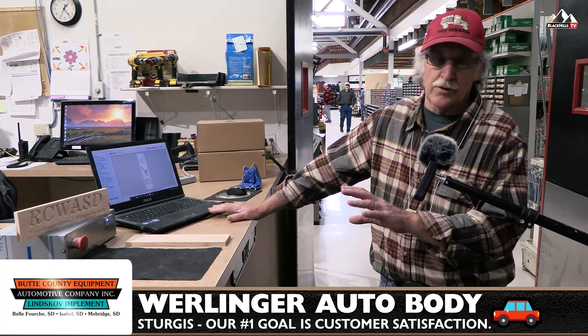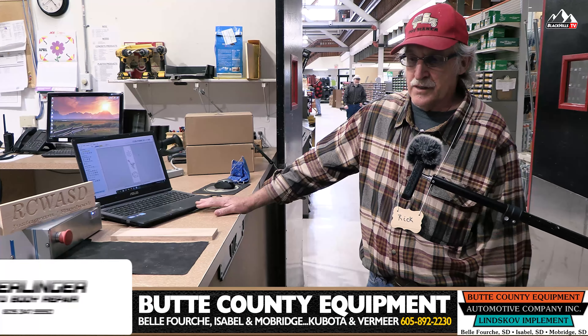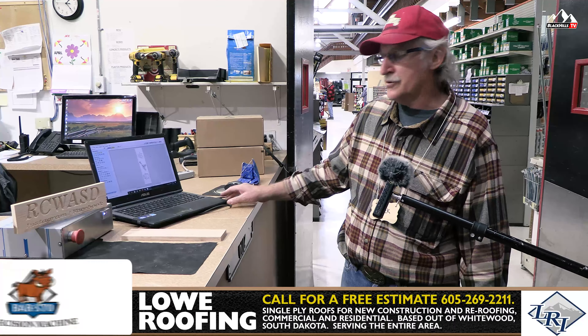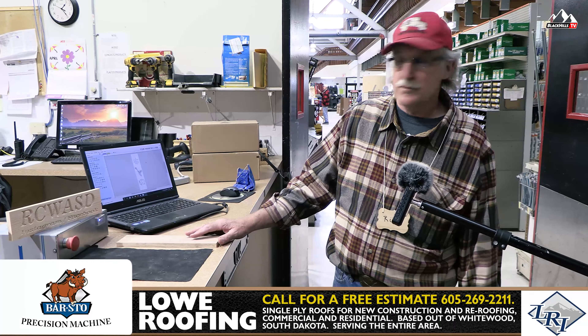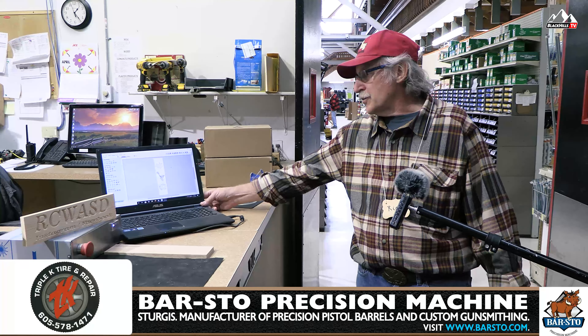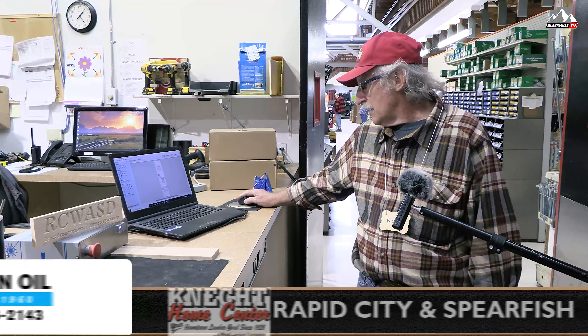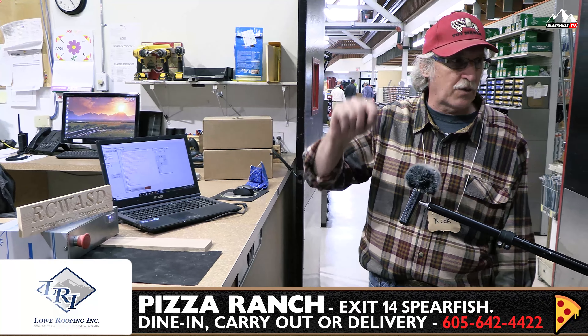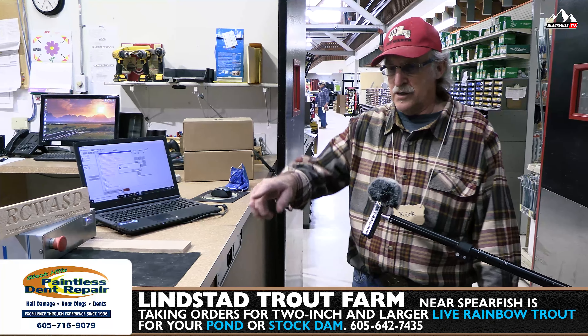This is a small computer-controlled router. It has a 13 by 25 cutting surface on it and I've had it for quite a few years. I usually put together a demo for the show so that I can demonstrate the computer-controlled router. A lot of people — they're becoming more common. More people have them. So it starts out with a drawing on the computer. When I draw it up, the drawing is converted into what they call a G-code, which is the information that the computer needs in order to run it. It comes up on the computer and tells the computer where to move the bit from place to place in both X, Y, and Z position. And when you run it, this will tell you that it'll take about eight minutes in order to cut what's on that board right there.